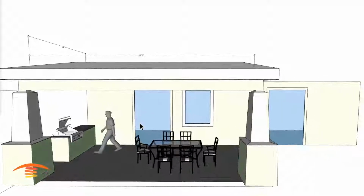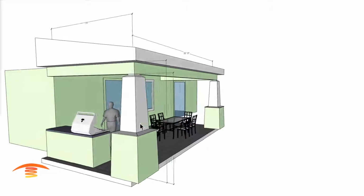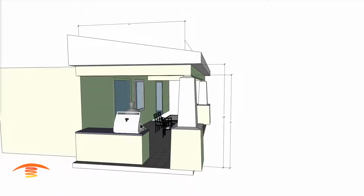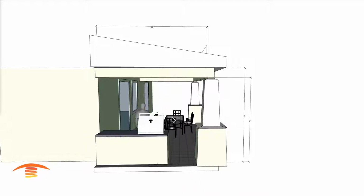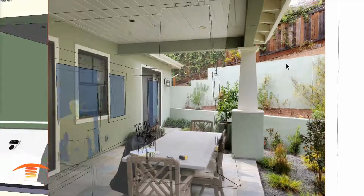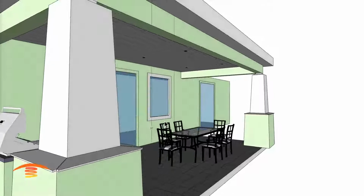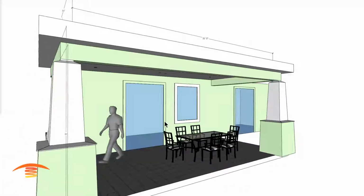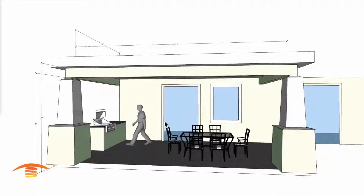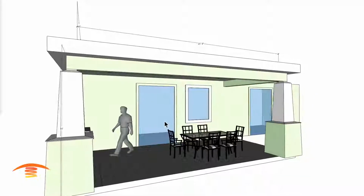One thing I do know is that this location is in a potentially high wind area at certain times of the year, probably the colder times of the year where there's storms and weather that builds up. But as you may have noticed in this image, it looks like a hillside or a bluff, and this is probably on the protected side of the property, is my guess. But it is something to be considered. If there's a lot of wind in here, we might want to increase the amount of BTUs for the project.